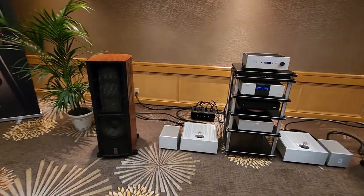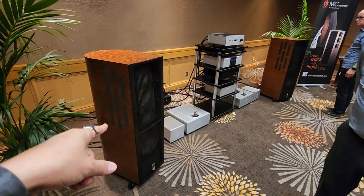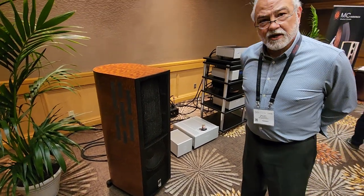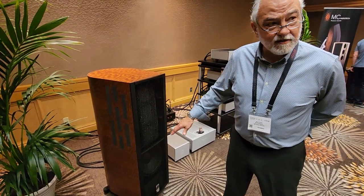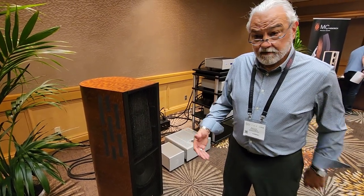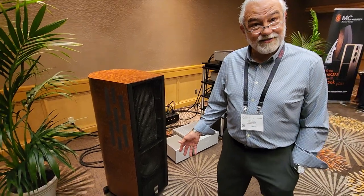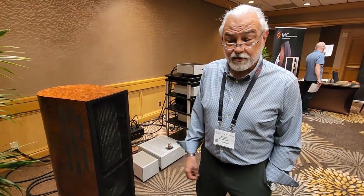Let's talk about the gear. Some friends have said this is their favorite system so far. This is an innovative design — it shares some things in common with other speakers, using three devices to get broad bandwidth, crossing over at 300 Hz. It has very good horizontal dispersion and is very efficient. Below 300 Hz it's coupled to a 12-inch transmission line, making a nice package with very good bass that can play loud or soft.